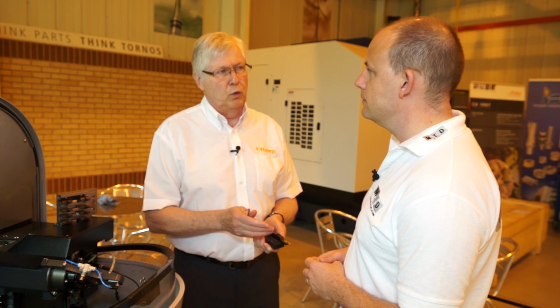So a lot of engineers that are watching this video might think, well, this is just for production, high volume machining, but that's not necessarily true. Not entirely, because although it's very useful on high volume production machining because you can run sister tooling and just swap tools and then do your insert change within the cycle time, it's also very useful for people who are doing a lot of changeovers.